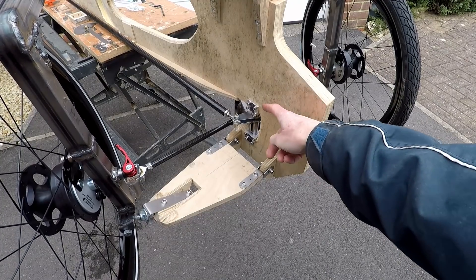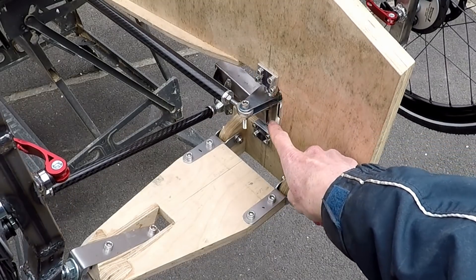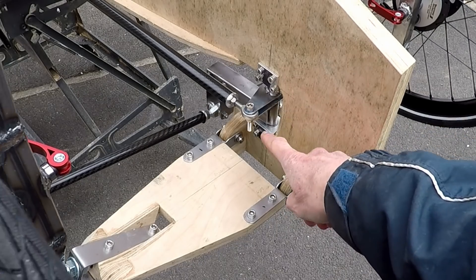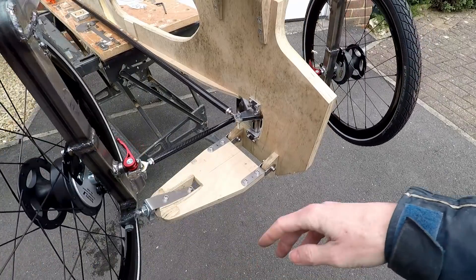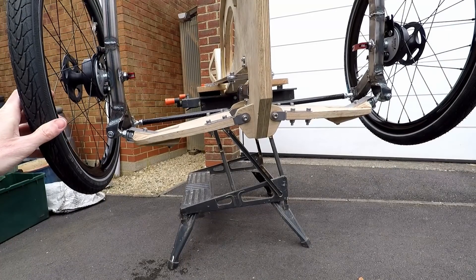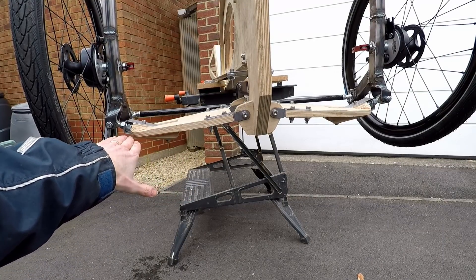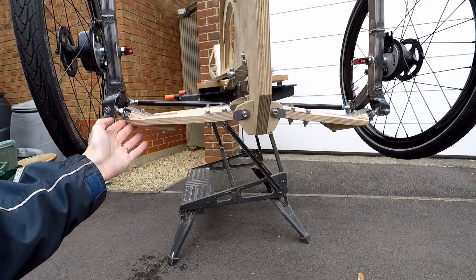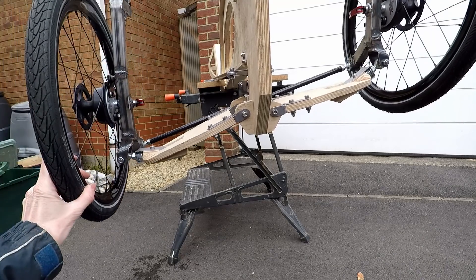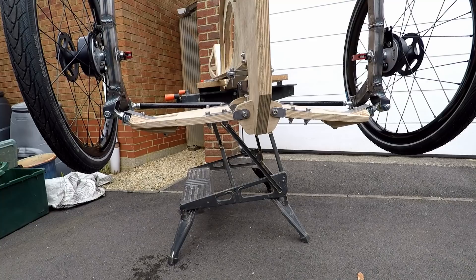Just coming back to the bell crank you can see that I've got these aluminium plates which are bolted through with cap screws. The vertical tube which the bell crank is welded to is fitted with pins top and bottom and there are ball races top and bottom that hold that in place and give it a nice free low friction movement. Coming right down to ground level, I had to adjust the lower wishbones to give an angled inclination to the outboard bracket. The reason I had to do this was because I was having clearance problems when getting to maximum tilt angle. So to avoid those clearance problems I cut out this piece of wood, glued it back in with epoxy resin and that has solved the problem.